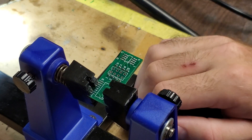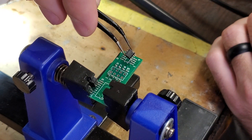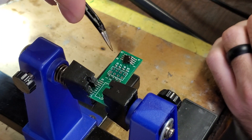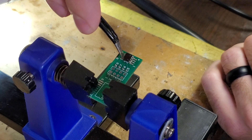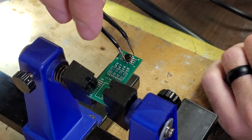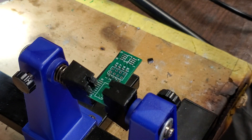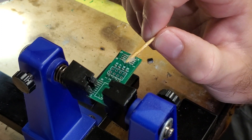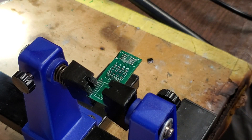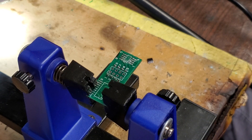We're going to take the BIOS chip and where that little divot is, we're going to put that in spot number one. Of course you're going to want flux and solder to do this. Before you get started, you might want to go ahead and put your own solder on these pads. You're going to need some flux — obviously if you're doing something like this you need to have some experience with soldering and disassembly. I have other videos that show you how to solder and disassemble the PlayStation 5. Now after we've got that flux on there, we're just going to put some new solder on those pads.